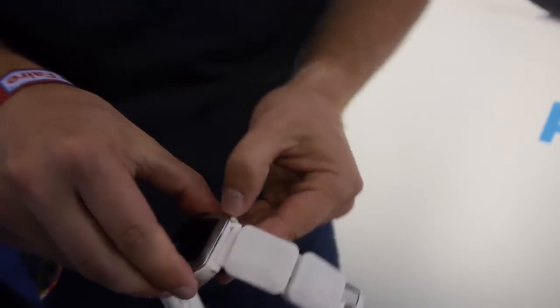One of the very exciting things in the new Pebble Time watch, besides the color display and a microphone, is that it has an accessory connector on the back and we have a completely open API for this accessory port. From a Pebble application you can use the accessory port as a serial port and transfer information to and from accessories that will be mounted on the band of the user — we're calling those smart straps.